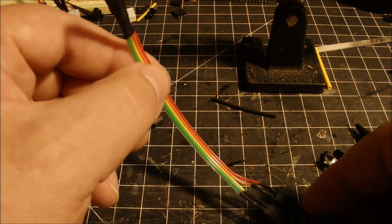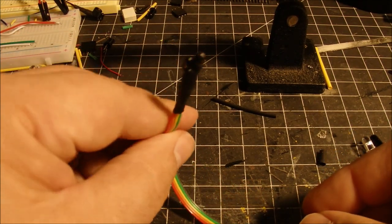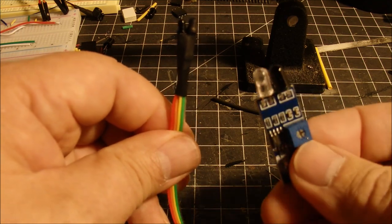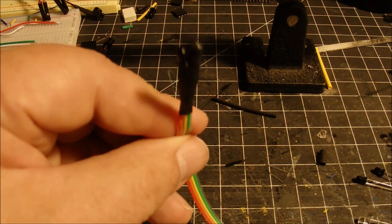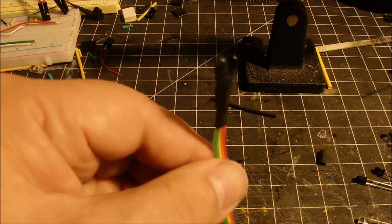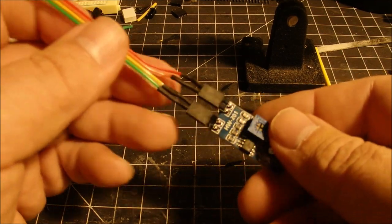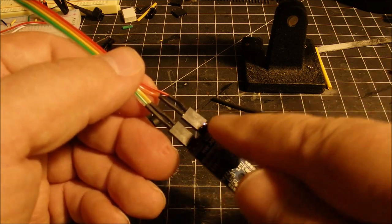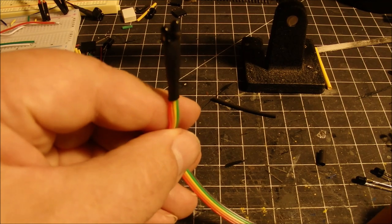Now this could easily be pushed up underneath your track. And this is much smaller to fit up through underneath your track. So this is a good alternative to trying to fit this thing up underneath your track. And you don't need quite as big a hole. You still have a pretty good size hole for these things, but it's a lot better and a lot easier than trying to get this whole thing up through underneath the layout. Plus, this is accessible for adjustments, and the little LEDs won't shine so bright that they shine right up through the hole of your layout.